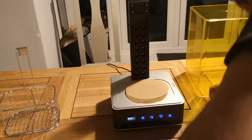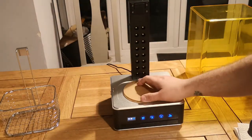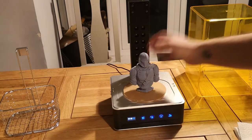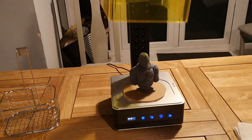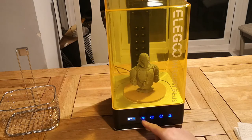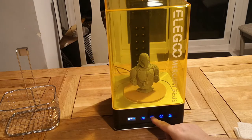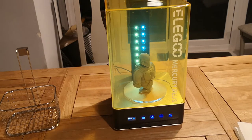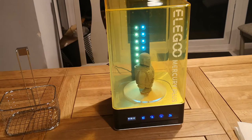I was just being a bit slow getting this hooked on, to be honest — it wasn't the easiest thing in the world, but there it goes. It's snapped on and you can see it turns quite nicely. The idea is you put the model onto the build plate, put the lid on — the machine will not function without the lid on, just something to be aware of. I don't know if it's weight-based or sensor-based. I'm setting it to cure mode and setting the timer for about two minutes, then just hitting start and it's away, curing. You can see it moves quite slowly, giving the lights time to cure the resin.